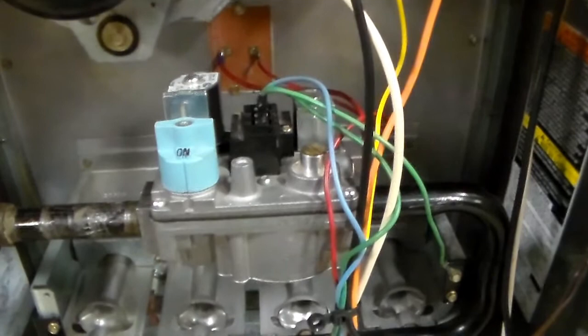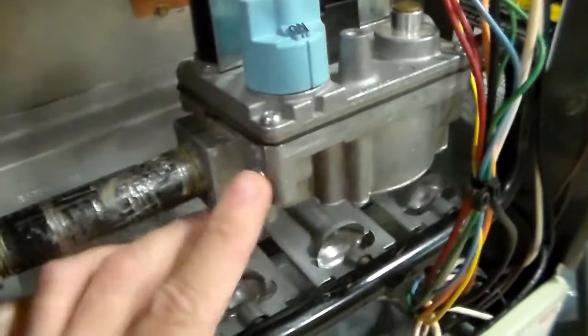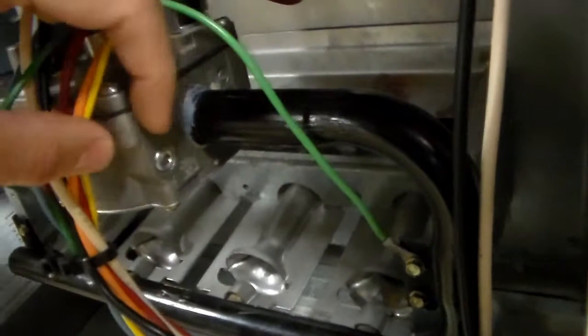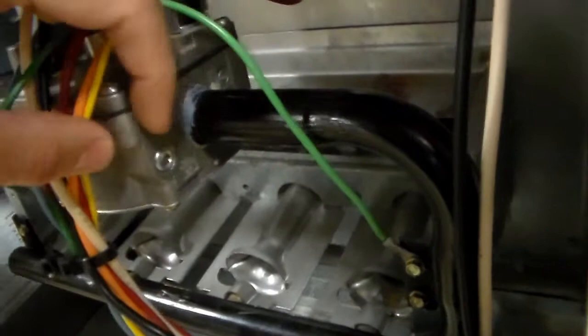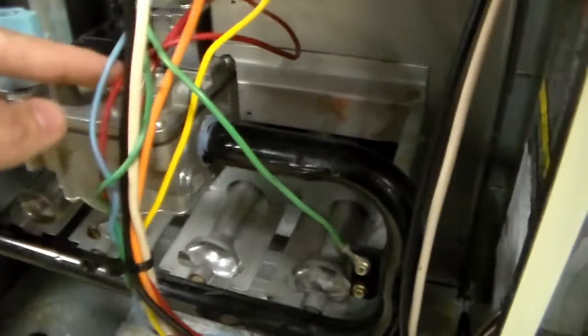Here's your last and most common style of gas valve. On top there's a little brass cap — take off that cap and underneath is the plastic adjustment screw: in to increase, out to decrease. There's also an allen plug, but that's on the incoming pipe, the seven-inch side — so your manometer goes on the manifold-side allen plug. Manometer goes there, adjustment is right here, and they'll ask you which way to turn it to increase and decrease.